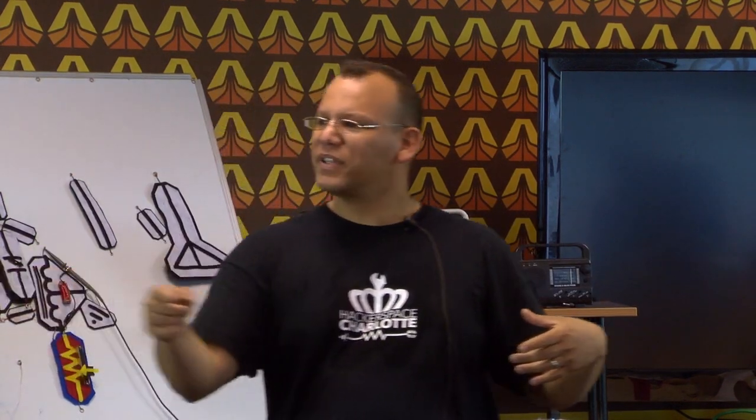Now, really, that's because it's alternating current. They don't go very far before they switch directions. But the electricity travels a lot faster than electrons move. Imagine, for another analogy, this one we might be able to hang on to. With electricity, whether it's DC or AC, if I've got a garden hose and I've got a bunch of marbles that I've piled into the garden hose, and the garden hose is full, the electrons are in there. If I pop another marble into the garden hose, the marble's going to pop out the other end. And if I keep popping marbles in, they're going to keep popping out the other end, right? Almost instantaneously. The instant I pop one in, one pops out the other side. Does that make sense?